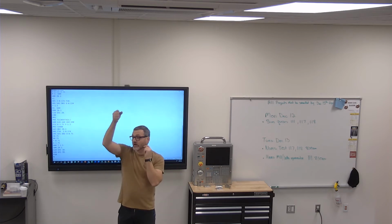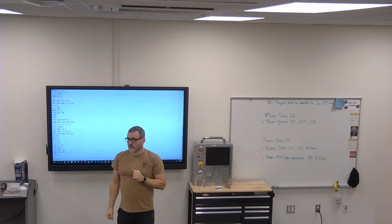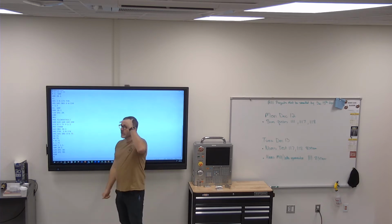On the VF3s, really on all the 3-axis machines, all the way up is at tool change level. Really? Because I've had to go up above tool change, and you have to come back down a little bit to tool change. You can move it all the way up and then bring it back down. Yeah, you can go past it.